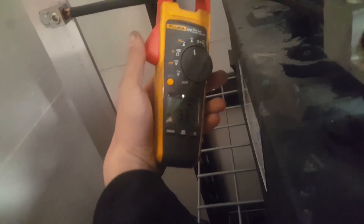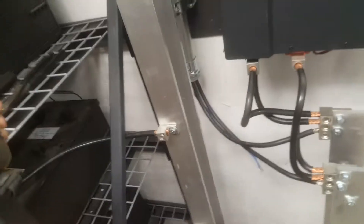This rack has something wrong. I've got to figure out why that rack is having problems. We were at 60 amps on the positive but we're at 34 amps on the negative. Let's go down a rack — we're at 36 amps on the second shelf from the bottom. And 11 amps on the positive. That tells me our interlinks are moving some stuff.